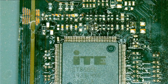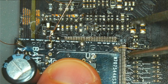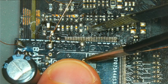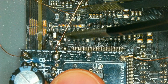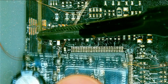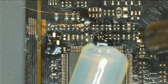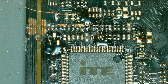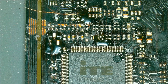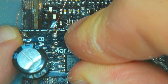Now it's time to take this PCB and put it on the board. I've mostly cleaned up the old fix — removed the hot-air-desoldered component and all the small wires. I need to connect: ground, the output wire to the left pad, 5V to the resistor side, and 3V to the appropriate pad. I'm heating up a glue stick and putting a little on the back of the PCB so it holds flat onto the SIO, then placing it down flush against the edge.